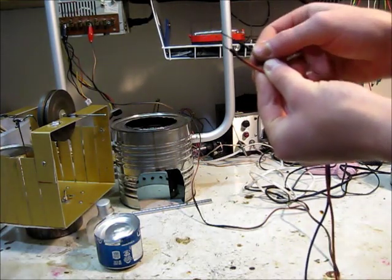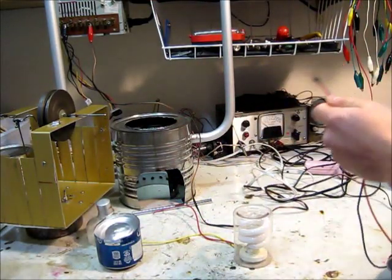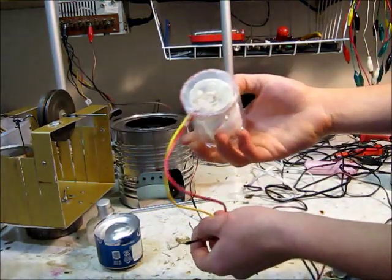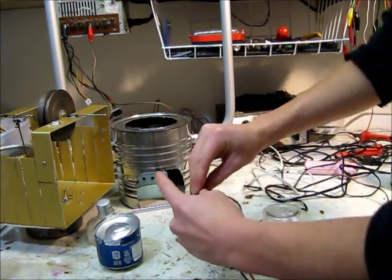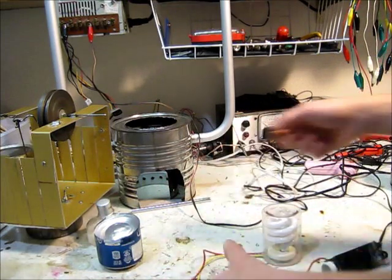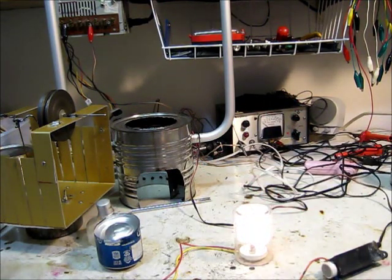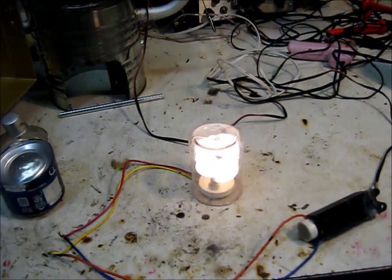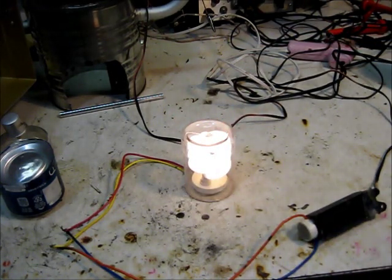I think I found it somewhere, I'm not really sure. What I usually do with it is when the power goes out, I hook up a compact fluorescent light bulb — the base was burned out on this one so I cut it off — and hook it straight up to the power supply. It runs off 12 volts, and I can hook it up to a 6-amp-hour battery. It doesn't put out a lot of light, but it's very efficient. It'll run for a good 24 hours at least with this much light output, because it only draws about 100 milliamps, maybe 200. It doesn't draw very much and it's pretty bright — brighter than a few candles.